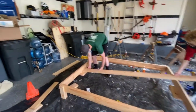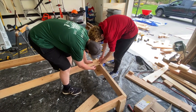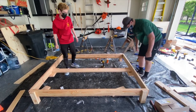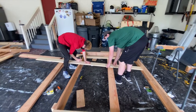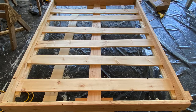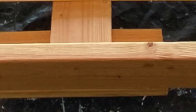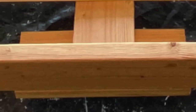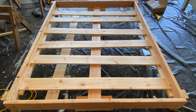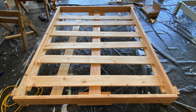This next step is for the queen bed only — measuring out and cutting the middle piece so there's just a little bit of space to drop the bed in. It'll fit in there pretty much perfectly using a two by six by eight. Then use your one by fives — they need to be at least 82 inches long for the queen — and cut them to drop in as planks. Additionally, for the queen, you'll want a support beam down the middle: cut a piece of scrap wood and screw it onto the bottom of the side piece, then cut a piece of wood to run lengthwise across the bed so the planks don't sag and break in the middle.